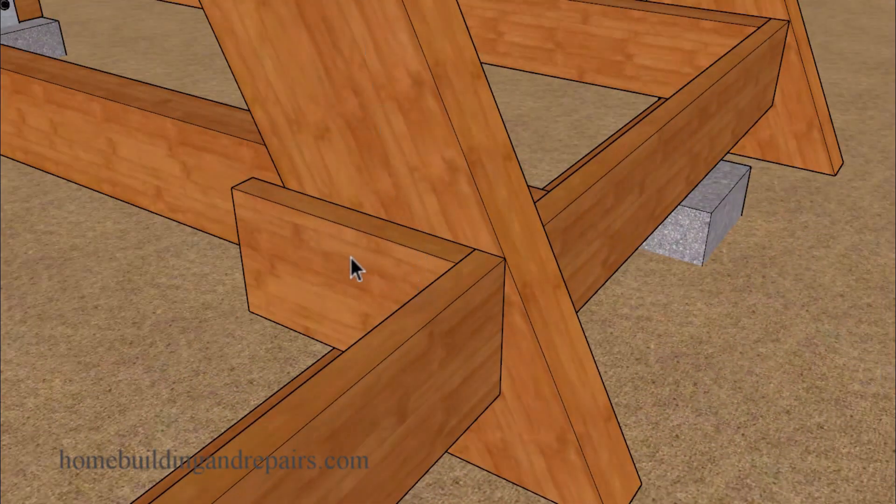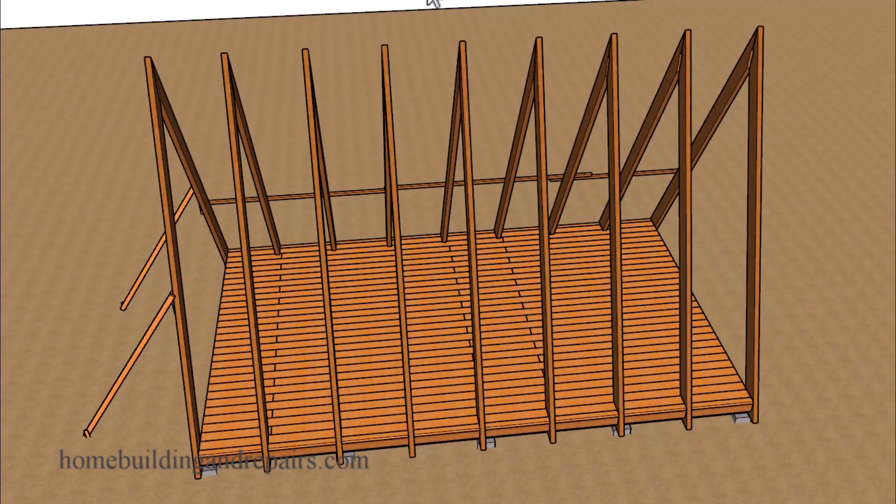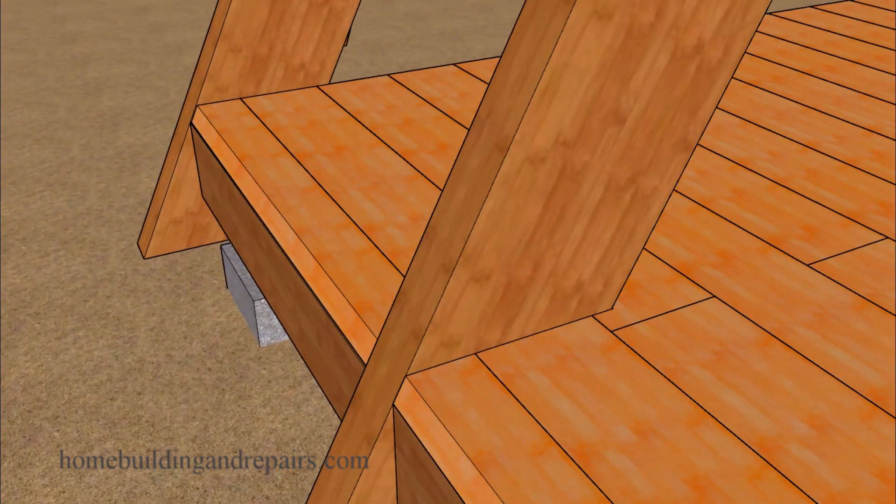We will need a block, but I don't think you need to get crazy with a lot of building hardware. You could simply nail the block to the roof rafter. Don't forget you're going to have a bolt or two coming through here, meaning you're probably going to have to notch some holes out of the block, or lower the bolts so you can use a 2x4 or even a 2x2 so the bolts aren't in the way of your framing. After this, we're going to install our floor sheathing — again 2x6 tongue and groove. You're going to nail the floor sheathing into this block, and then the roof sheathing into the floor sheathing, making a nice transfer.